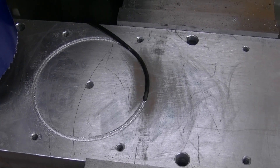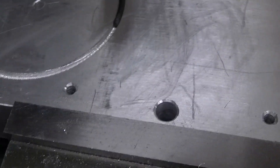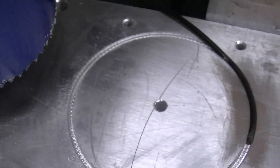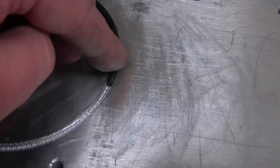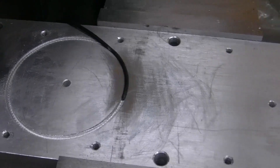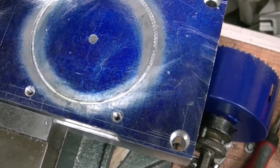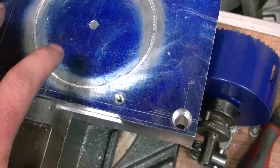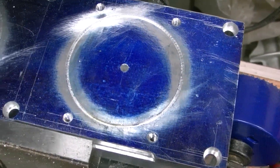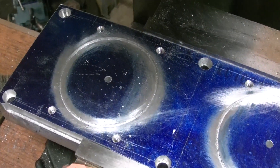There's my test piece on the back side. Like I said, this will all get milled out so there's no loss there. I used that four-inch hole saw and it came out pretty good. The o-ring sits just a little above and you can press it down and make it go level with the top of the aluminum. So I'm going to flip it over and do it for good and hope it works just as good as this side. I got my o-ring grooves cut and they came out pretty good. If anything I might have cut it just a hair bit deep, which is no big deal because I could just skim the top off ten thousandths or so. I just need a little bit of that o-ring sticking up and tighten that throttle body down and it should be good.